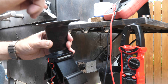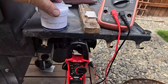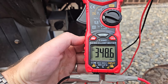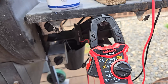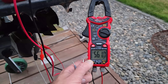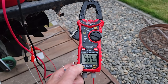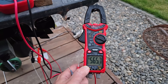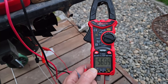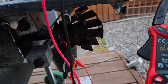I don't want to cover my grill with giant heat sinks, but if that's what it takes to make this work, I'll do it. With the thermal grease applied, I'm reading 220 milliamps and 0.35 volts. That's an improvement. The next day, getting record voltage — it's late in the evening so it's cooler, and I'm getting well over half a volt, up to 0.57. This is just the open circuit voltage with no current drawn.